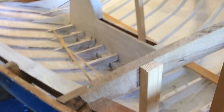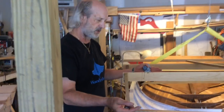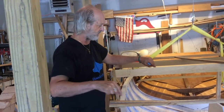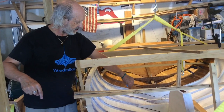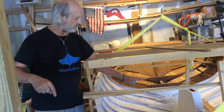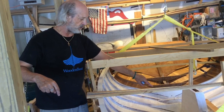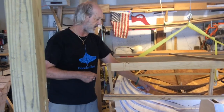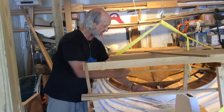The other thing I had to do was use the floor jacks to lift the lead up, because as much as I tried to drill straight down, I'm finding that back here in 14, the angle went down like this. So unless the lead is right up next to the bottom, they don't just drop straight through. I actually had to pound on these — I took the hammer and a piece of oak so I didn't screw up the tops of the threads, put the wood on top and then beat it down with the hammer.